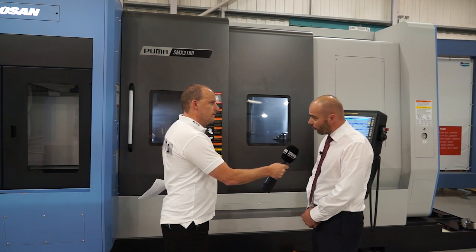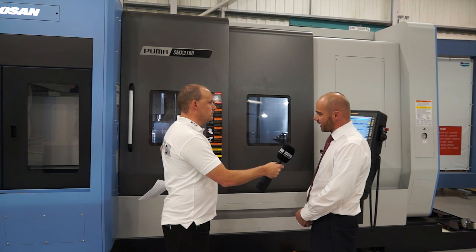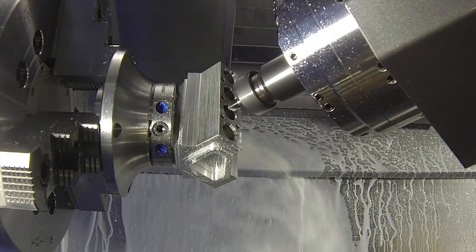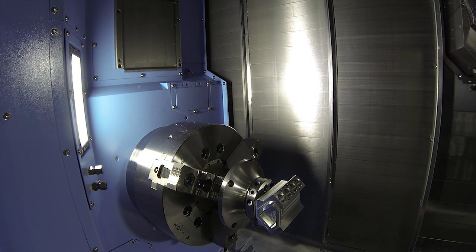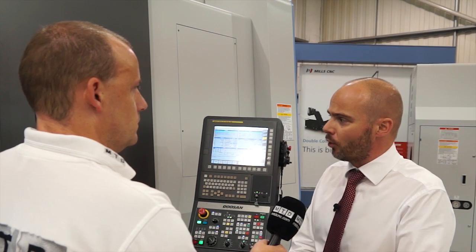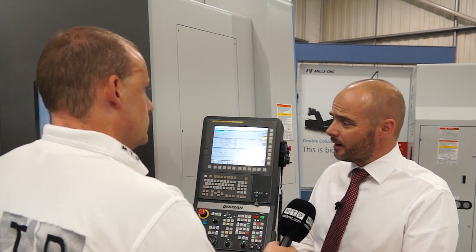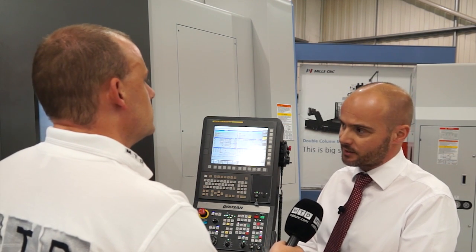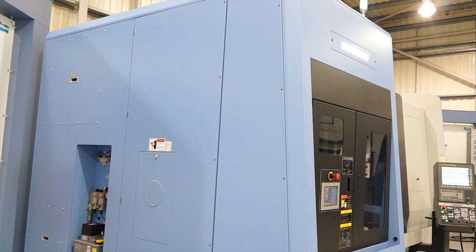So the actual movement of the machine — the axes — are those on roller guideways? Yes, all axes run on linear motion guideways, what they call super-precision class, so they're high-accuracy guideways. The X-axis guideway is oil-cooled as well, and the ball nut is oil-cooled by the oil cooler. That means rapid rates have been increased on the new Super MX to 48 metres a minute. Because the old models were box guideway machines? Correct — the first-generation MX machines were on box guideways, which from a rigidity point of view is very good. But these machines tend to be more about production and reducing non-cutting time, so the linear guideway is the way to go. With linear guides you can take smaller cuts but more of them in a faster cycle time. Generally, linears don't have the same vibration-dampening characteristics, but on a high-precision machine like this, we're not talking about heavy forgings — so for the sort of work it does, linear guideway is precision.